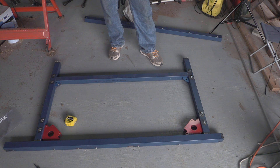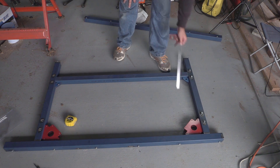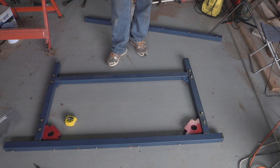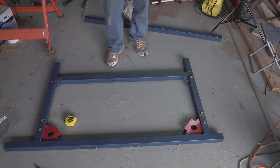What we'll do is — I was going to put some tacks in place to start, but I think what I might do first is clean up these welds here and here on the foot, just to dress them up a little bit and make it look a little neater. It'll be easier to do that while they're in individual pieces instead of having to use the grinder while holding the full part. I'll just put them in the vice and do all my grinding outside. Then we'll come back to this assembly on the floor and put some tacks in place.